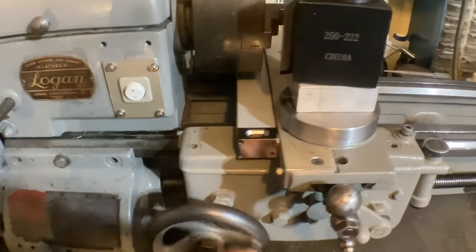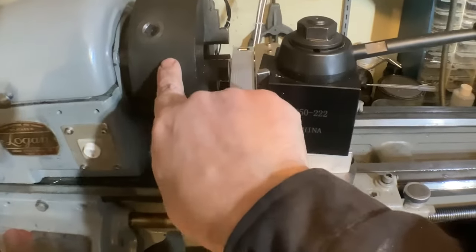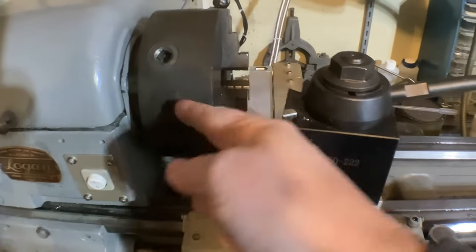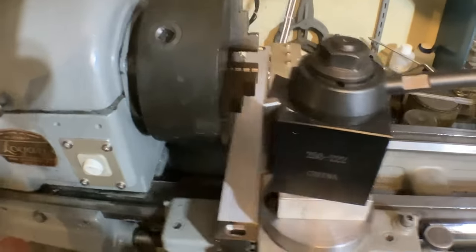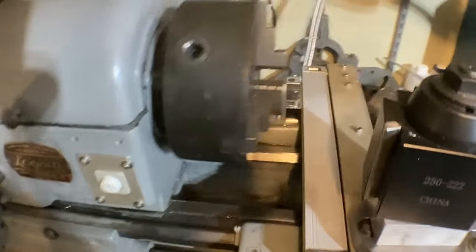On the front, the scale does go all the way under the chuck — I'm bottomed out here. Usually when I'm that close I'm not using the chuck anyway; I'm using my ER32 collet set. So it's a little close but it does fit. I might look into a smaller chuck anyway.